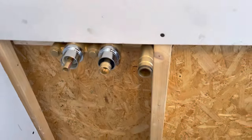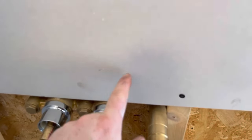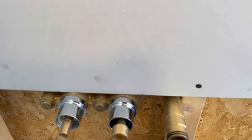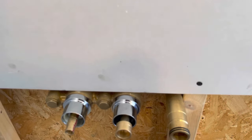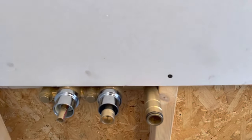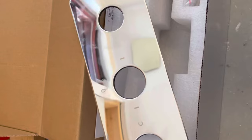Next up when I get my bracket on, I get a bit of a sheet of plasterboard. What you're going to want to do is put the plate on to make sure — see these little big fat nuts at the back — see if they're protruding out past the tile. What's going to happen is you're going to be left with a big gap and it's going to look like a terrible finish. So these little big fat shrouds actually need to be behind the plasterboard — that's like a certain depth. If you read the instructions it'll tell you. So I'm going to take that bit of wood out and put two bits of skirt on top of each other, screw it in and it's going to be solid.